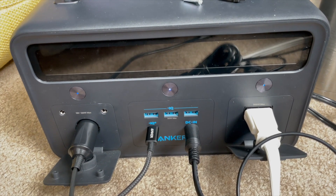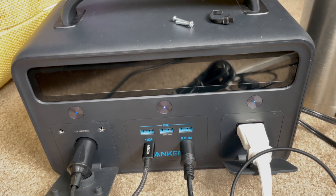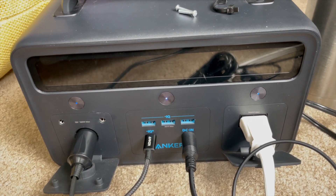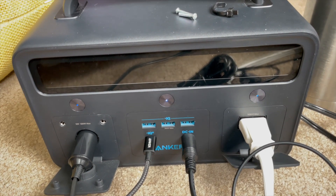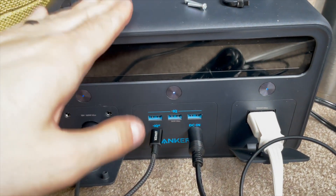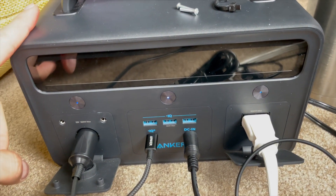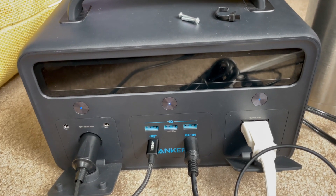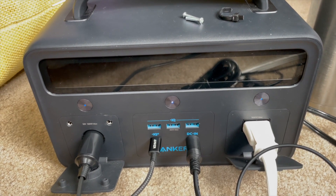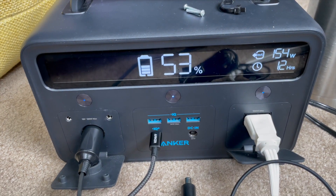The Powerhouse 800, which is basically the same design but scaled up, has a 500-watt inverter. I'd imagine that's probably a 60-amp fuse, or possibly dual 30-amp fuses in parallel. I'll take that one apart soon enough. Having taken this one apart, it satisfies my curiosity about whether I can work on these if I need to. It comes apart in a way that isn't super destructive and doesn't require crazy tools — it's fussy and requires patience since it's not intended to be user serviceable.